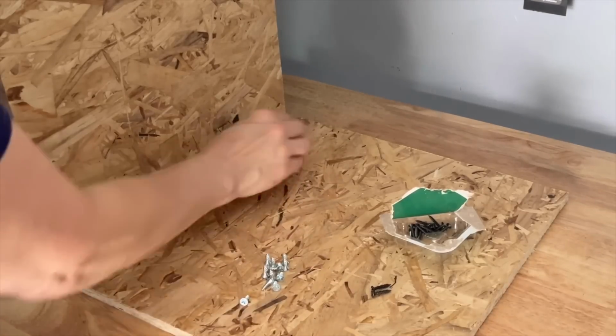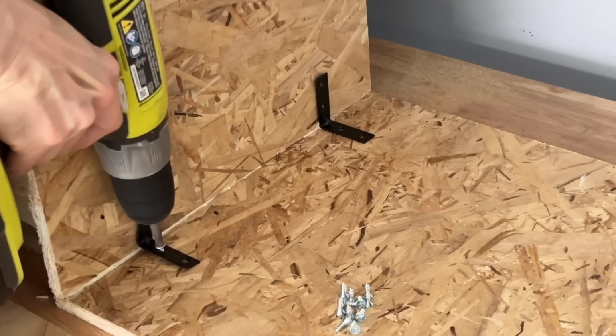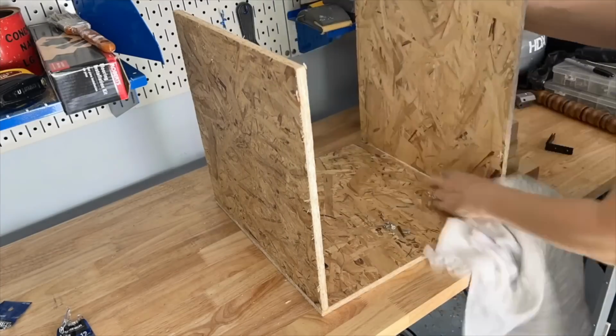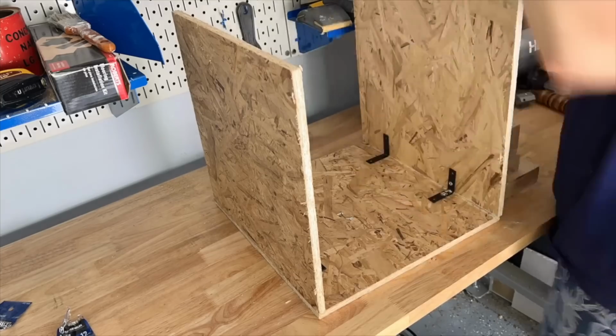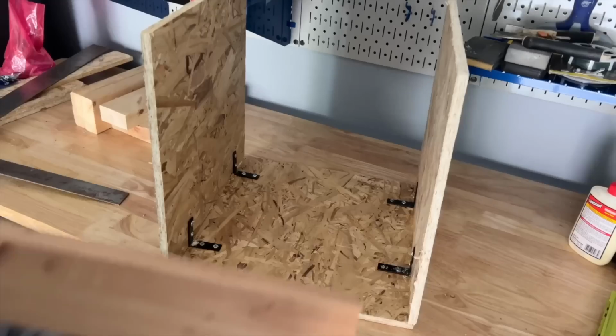creating a 90-degree angle. Screw in 2-inch corner brackets to secure the L shape. Don't use the screws that come with the brackets as they will be too long. Instead, use some 1/2-inch screws. Set aside those original screws though, and you will use them later. Screw in 2 more brackets and you will now have a U shape.